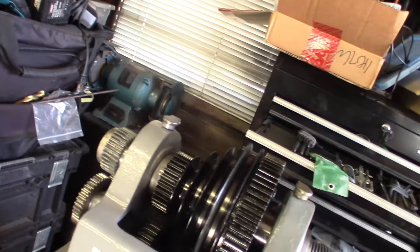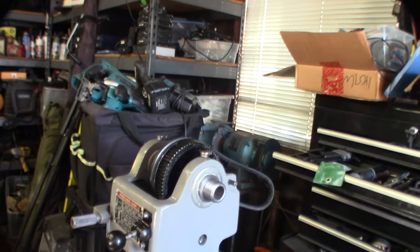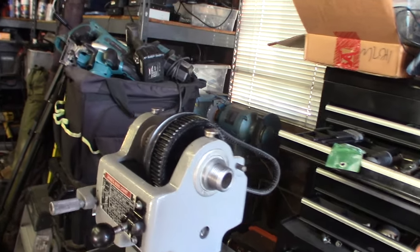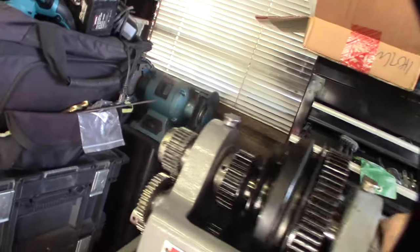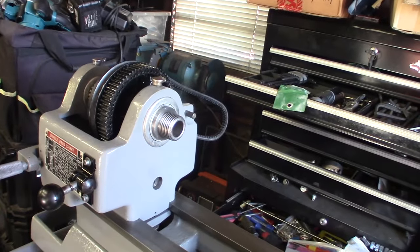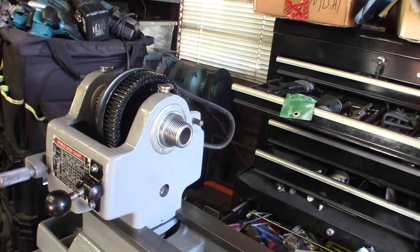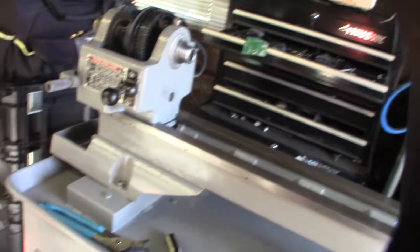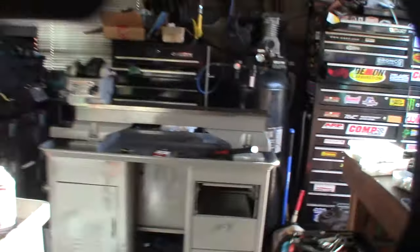Taking it apart again didn't actually take that long because I had the shaft polished - everything comes apart nicely and easily, just a couple minutes to swap the belt. It helps when you know exactly how it comes apart. I know how to dress the collars, how to get the Woodruff key and set key in there. Here's the belt - installed. I'm probably going to have at least 40 hours in this thing total, maybe more. All right, that's part two - got the headstock done. I'm 3D printing some drawers right now, with drawer liners to organize the tools.